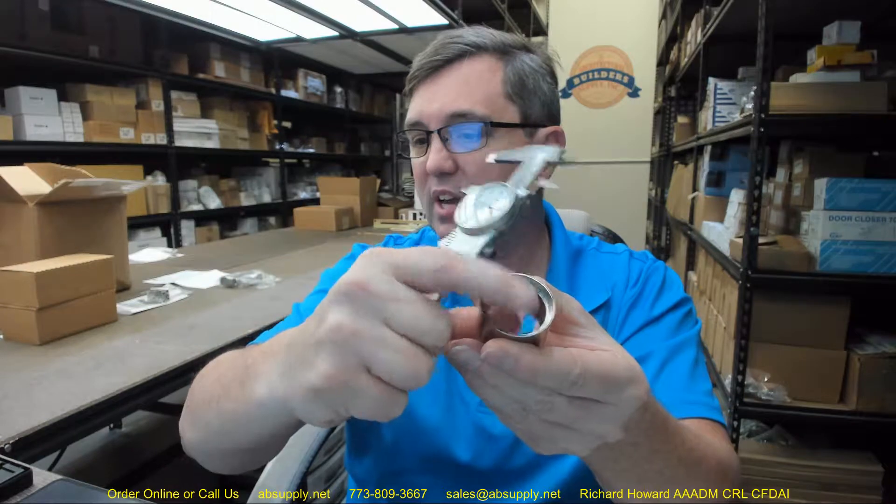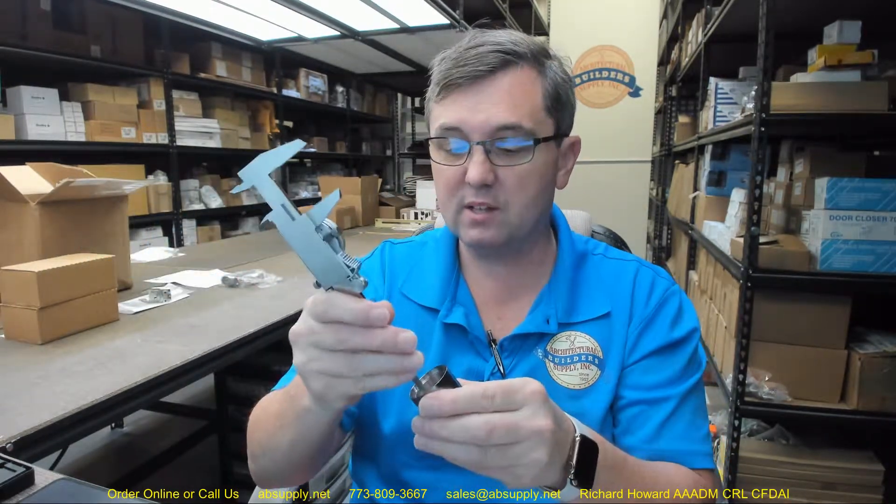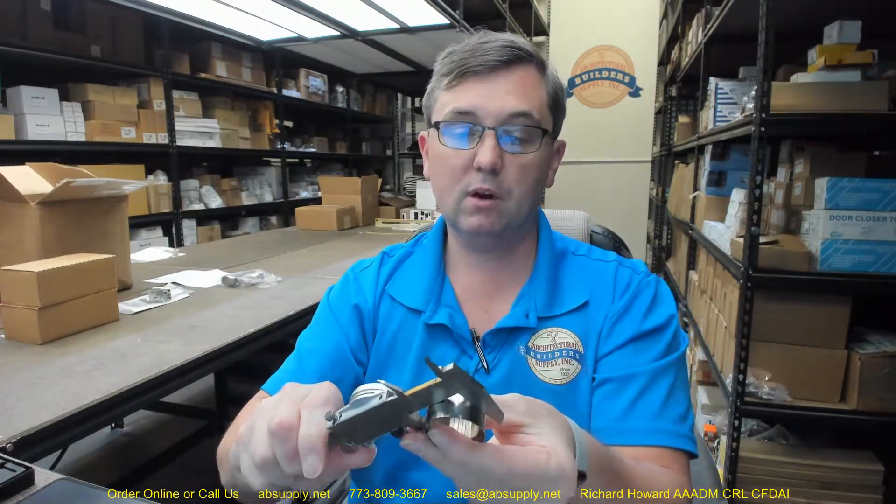So the overall length of this collar should be 0.90625. Measuring with my caliper, it reads 0.913 — close enough. The recessed area is listed as 5/32nd, which is about 0.15625, and my caliper reads 0.164. The inside diameter of the collar measures 1.185 inches.